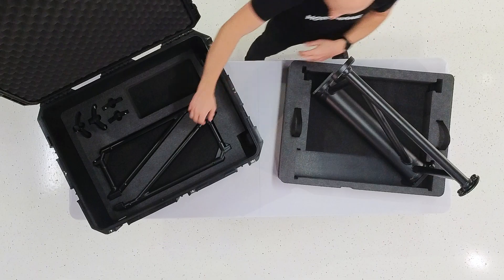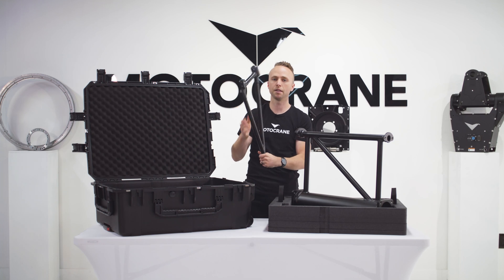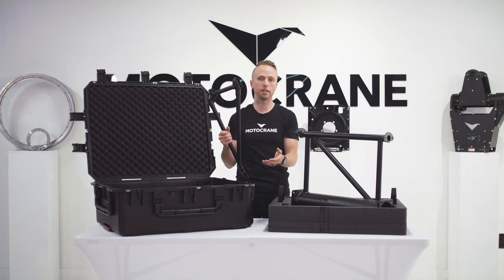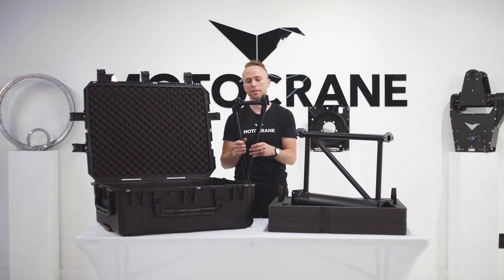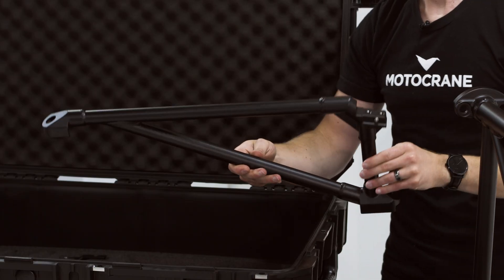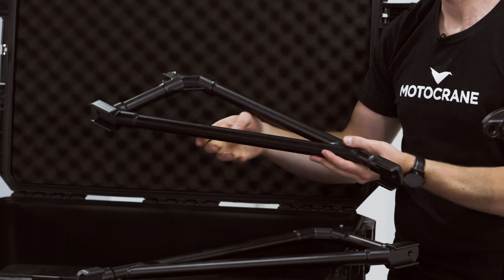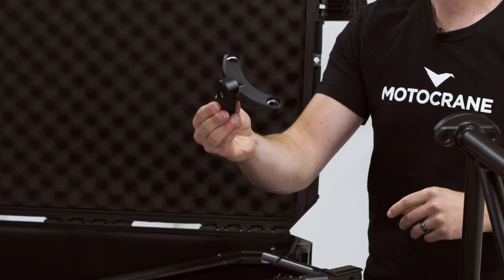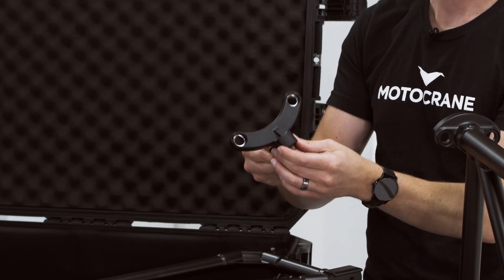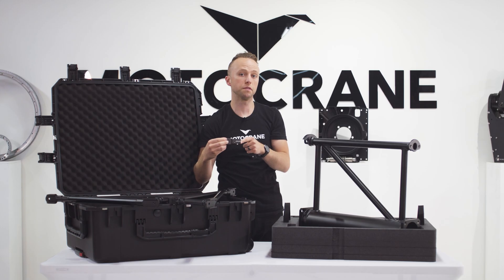The other parts included in the Radical LS kit look like mini heavy lift parts, because the standard heavy lift upgrade kit is required for using the LS kit. In both long and short modes, you need that additional lateral bracing for adequate arm strength to achieve those ratings. The kit includes a shorter heavy lift brace — two of them, one for each side of the arm — plus two brace mounts and adapters for use in the 9-foot and 14-foot modes.